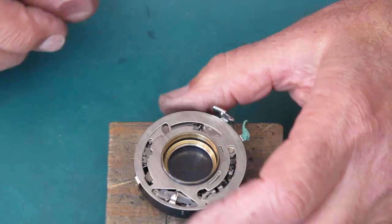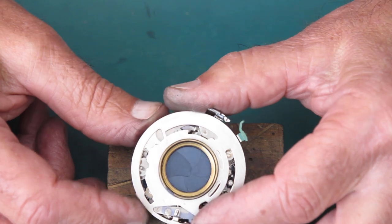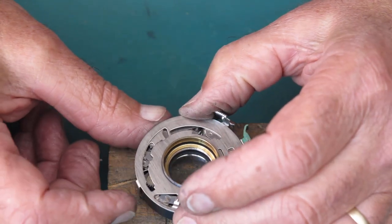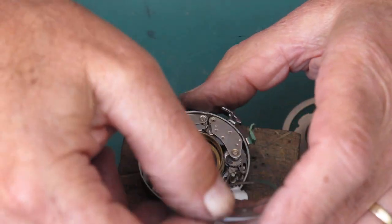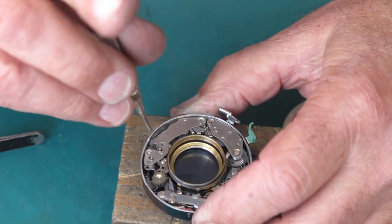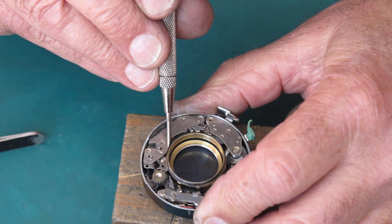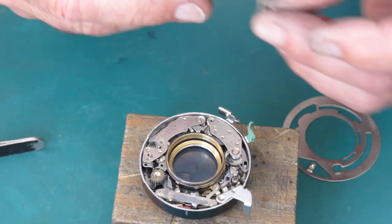If anything that's slightly slow. What's it like on the fifteenth? Definitely slow. I'm going to speed the action up by moving the retard gear train outwards for lesser engagement with the main drive cam. I'll slacken that screw off, just move this out slightly. That was a lot — probably too much, but we'll see what sort of result we get.